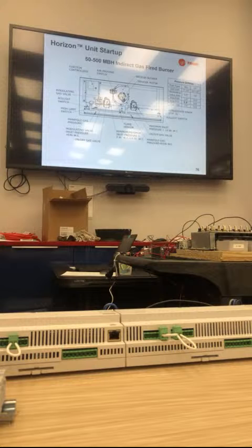I've had some of them where I've actually been on the phone with tech support, and they've gone in and changed the program, because when it does that, it does a flame fail lockout. Yep. And it locks you out in the program. I think it's programmed in TGP, it's 60 minutes before it resets. Yes, so 60 minutes, and they're complaining. Right, they're freaking out on you.